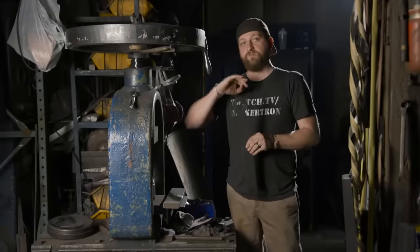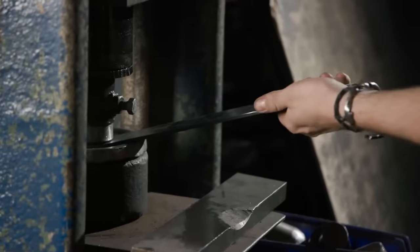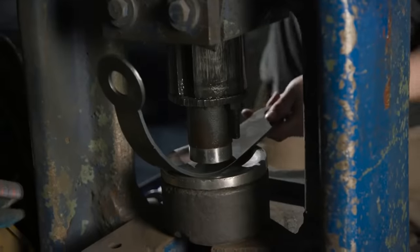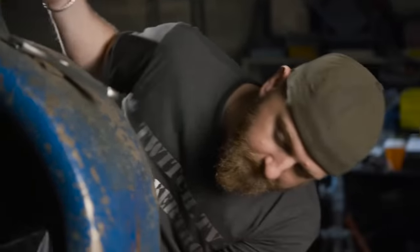What we have to do now is put our D shape into it. In the anime, it looks pretty flat, but once again, if you put a little bit of curvature, a little bit of dishing in a flat piece, it looks much more pleasing to the eye. So we're gonna go back to the screw press, start by giving a really light dish, and then do any hand forming that we have to do afterwards.